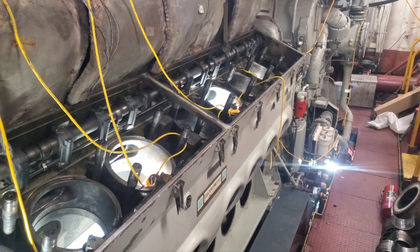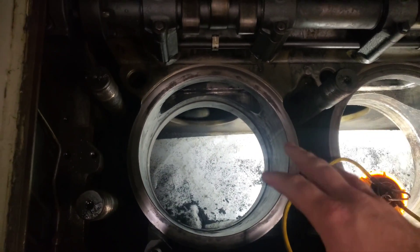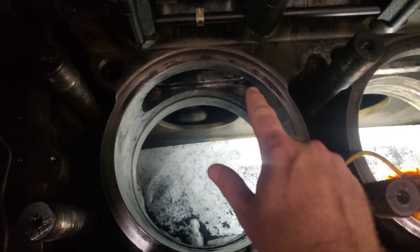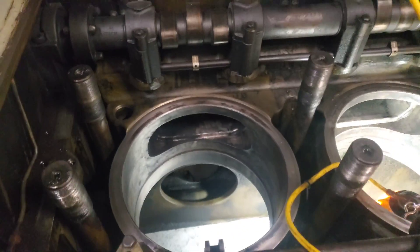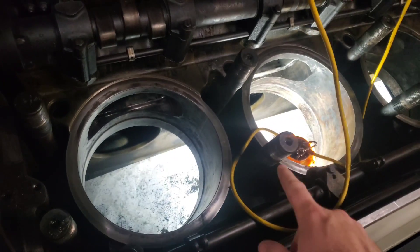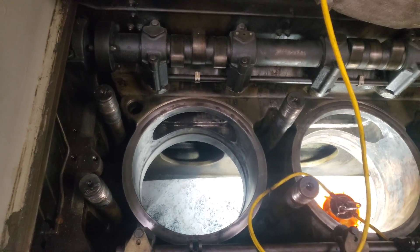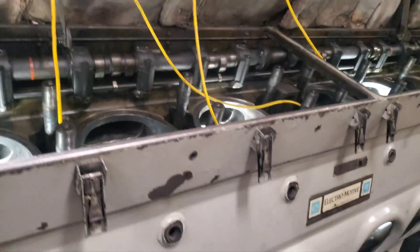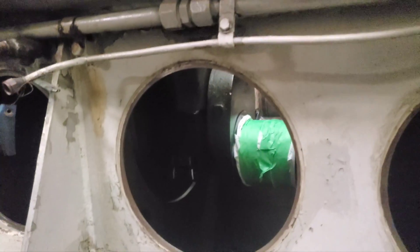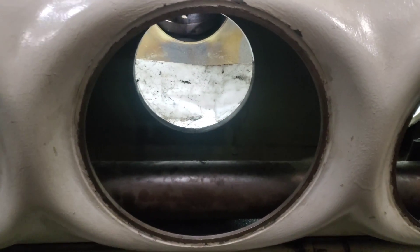That's what makes these really easy to work on — all that stuff comes out as an assembly. What you're left with is the bore and the crankcase. This is where the cylinder liner would fit. This space here is the exhaust trunk, so the exhaust valves open, that puts the exhaust up and out to the turbo. You have the big head studs here — the head studs retain the entire power pack assembly, so the liner and all that. Camshaft up there. Like all General Motors stuff, this is modular, so the cams and cranks are split. There's the crank down there — it's just polished. This pipe here is a cooling tube, so that's cold jacket water that's then put through a jumper through the airbox to the liner.